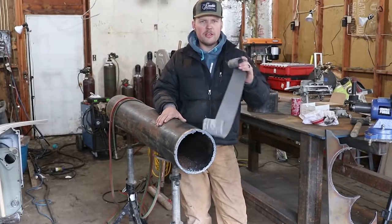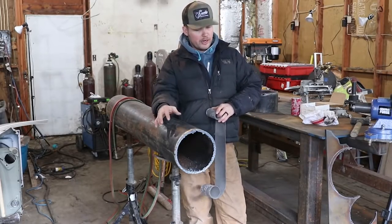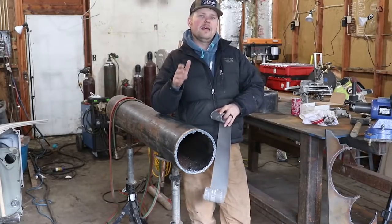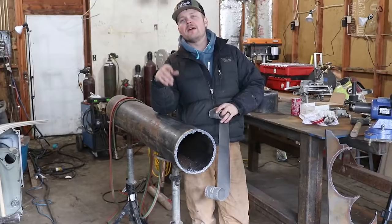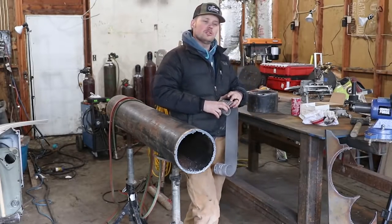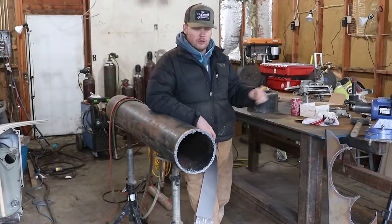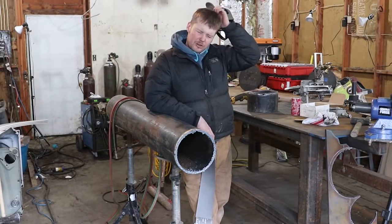But if it's the only way you can cut this, then this is the way we're gonna do it, all right? So I'm gonna bring you guys all over here. We're gonna lay this out with this. I'm gonna show you how to make sure all your stuff is straight, and then mark it out. We're gonna cut it with a torch, then we're gonna mark another one out, and I'll show you a skinny wheel, all right? I don't wanna use a skinny wheel, but, oh yeah, I do, I got one right there. I will show you, use this to a certain degree, all right? I'm not gonna cut all the way through one of these. It just takes too long, it's a lot of work, and it's loud, and it throws a ton of sparks.